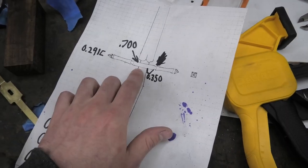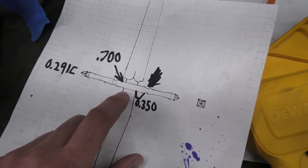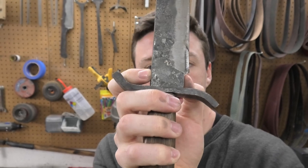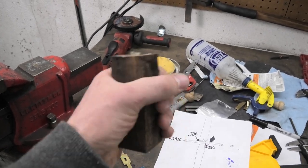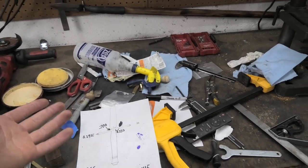So I think I'm gonna work on getting the handle shape so it's not just a block right now. I want this width of the handle to be the same as the width of that section of the blade. If we look at this Bowie knife that I made a long time ago, you can see this section of the ricasso doesn't line up with this section of the handle — that looks really stupid. So I want to be careful with this knife to make sure that they line up and look really good. For the handle shaping, I think I want to make an octagon — a completely symmetrical octagon — I think that will feel really cool in the hand to have all the sharp lines.